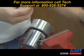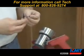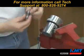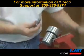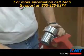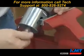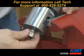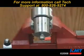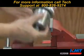Apply a little goop to the outside of the seat and to the bottom area of the adapter, and also to the threads of the adapter, and thread it into the valve body. And we want to torque it to 50 foot-pounds. That's ready to install on the machine.